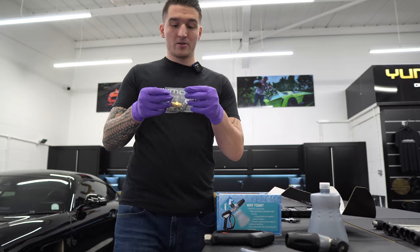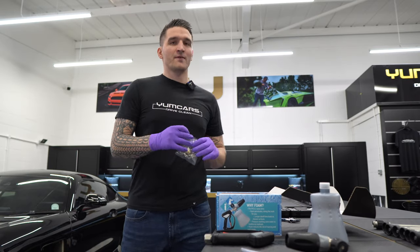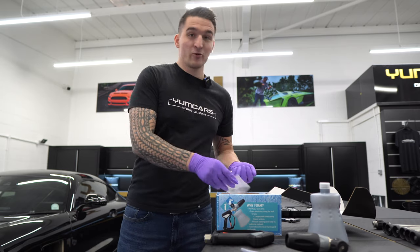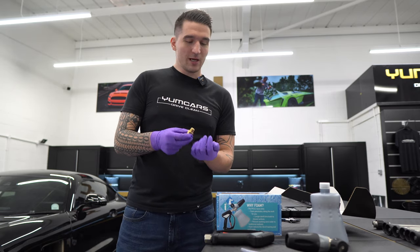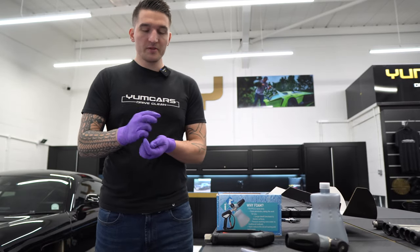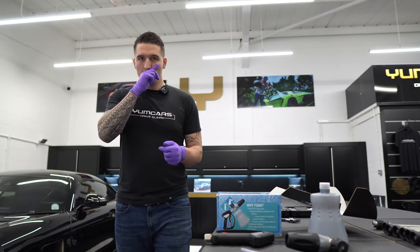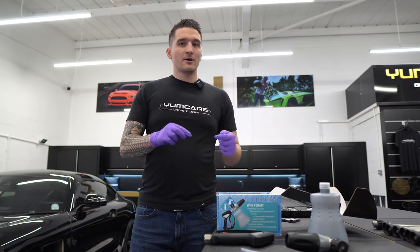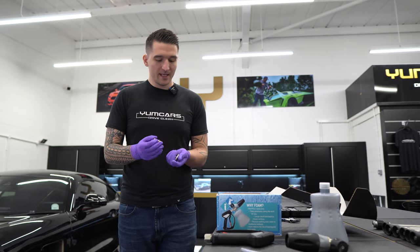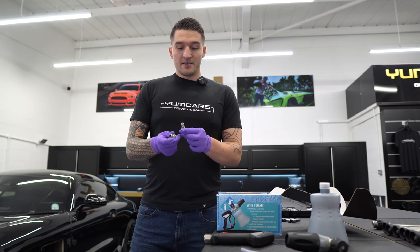Right at the bottom of the box you will see a box of fittings. They're very self-explanatory but I'm going to show you up close each fitting and where it goes just in case you don't know. The brass fitting you don't need for this — you've got the new orifice for the PF-22 with the 1.25 already pre-installed. If you need a 1.1, this is it, but for this application you don't need it.